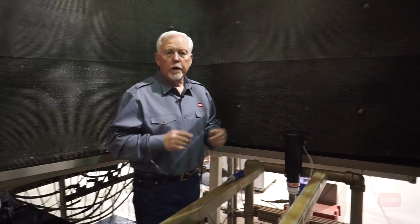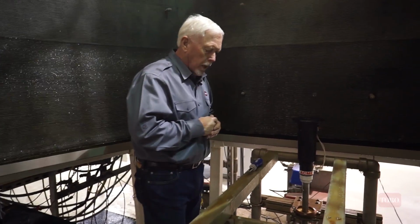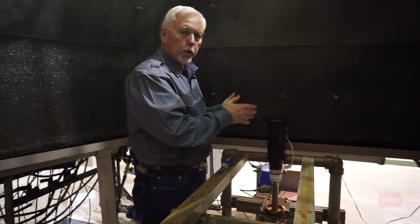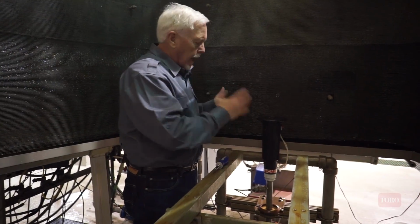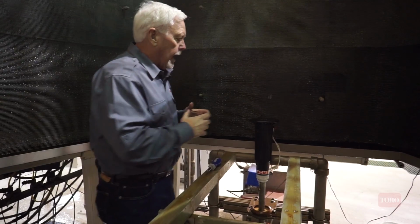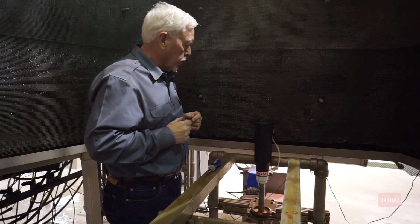Now in comparison, we're going to look at the Rainbird 751 part circle sprinkler. And the first thing you'll notice, again, there is no pull-up feature that would enable you to lift that riser up out of the body to determine what the arc setting is. And there are no graphic indications of what the arc is currently set to.